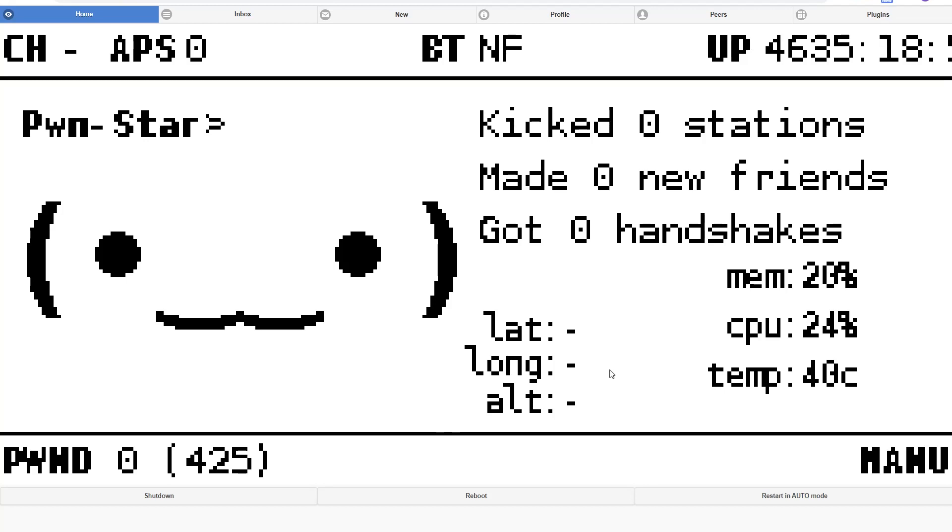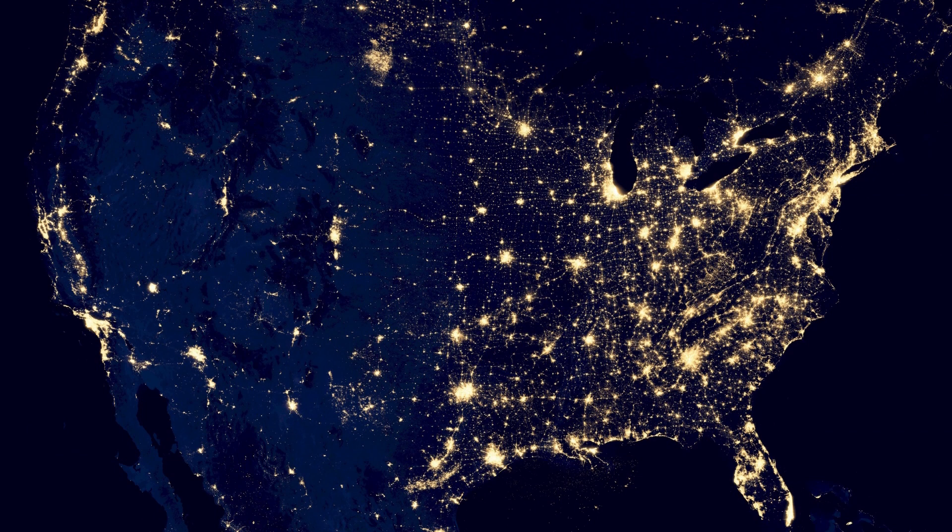You have to be outside to get a GPS lock. On this device I've seen it get a lock in two or three minutes, and I've also seen it take over 10 minutes — it really depends on signal strength. Also make sure you're not moving. I tried it in a vehicle and it never got a lock, but once you have the lock, traveling in the car is no issue and it maintains the lock. Being still in one location is really required for the initial lock.